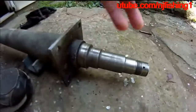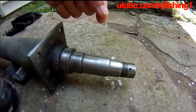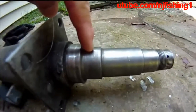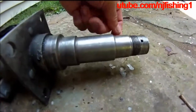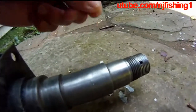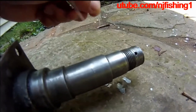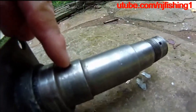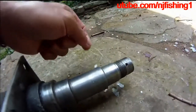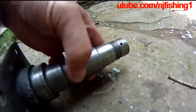When I got the new axle, I had them side by side and they looked similar. I don't have a tool to measure the diameter, so what I'm going to do is use a fishing line to wrap around this, cut it to the length, and then measure that — because that is the circumference. The circumference equals 2 times pi times the radius, or the diameter times pi. So I can take the length of each piece and divide by pi to get the diameter. That's how you do it if you don't have a measuring tool.